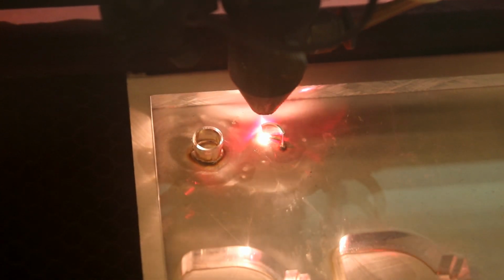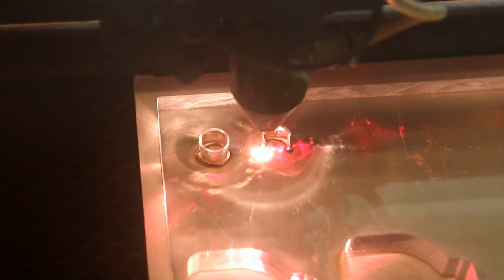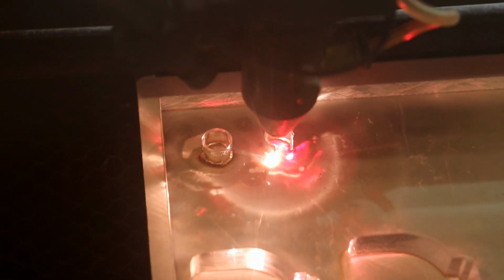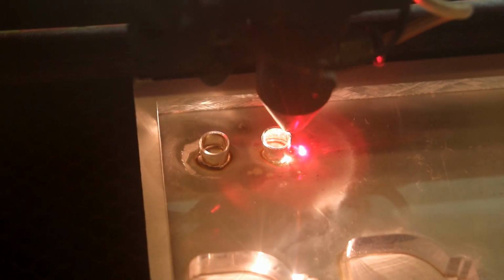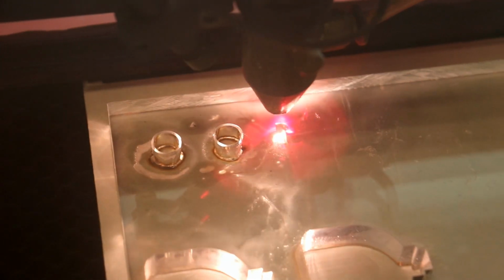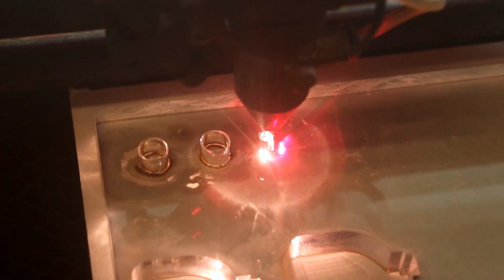It really does work very well, because the alternative is to lift these 10mm acrylic probably 20 or 30mm up, so by the time the remains of the laser go through it and hit the inside of the laser cutter, they're out of focus sufficiently not to set fire to things.